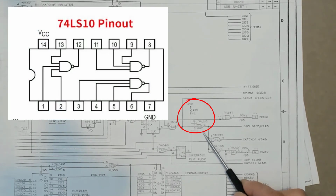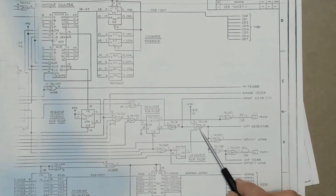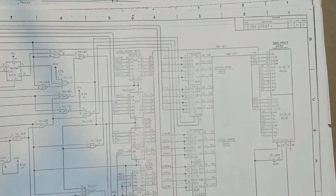So from a design perspective, they weren't making do with whatever gates they had available. I mean, they didn't need a 3-input NAND someplace and were just using up the extra gates in the chip to avoid adding another 2-input NAND. They were intentionally using 3 inputs because these are all 3 of these gates. There's one there, and one there. Those are all 3 gates in A88.